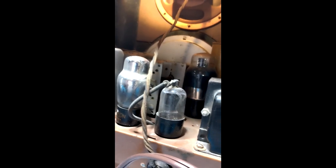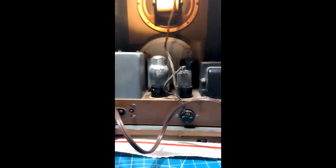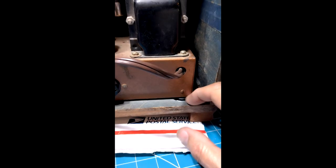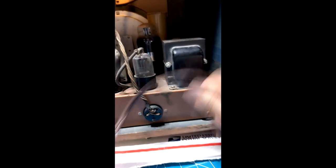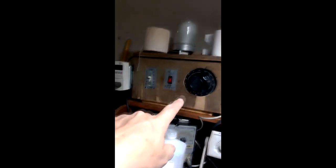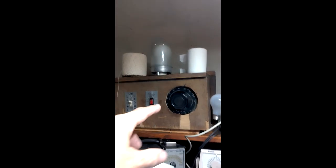You've seen what's going on with the hum and the tuning. There's a string in here slipping on a pulley, so it's not turning. Everything else looks okay. Somebody has definitely worked on it — we've got new bushings underneath the chassis and a new line cord, which is good. On a transformer set, how the cord is connected is not that big of an issue.